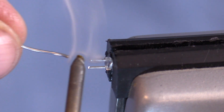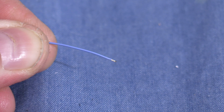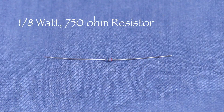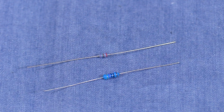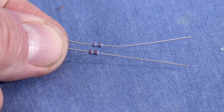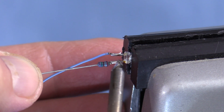Doing this kind of work is easier if you clamp the LED in some kind of holder like a small hobby vise. You can usually strip the insulation of small wire like this using just your fingernails — I like doing this because I know my fingernails won't cut any of the metal strands. Always use rosin core solder for electronics; acid core solder can damage electronic components. A small pencil type soldering iron in the 20–30 watt range is ideal for this kind of work. This is a 1/8 watt 750 ohm resistor — these are what I use for headlights most of the time, though a 1K ohm will also work. 1/4 watt resistors are also okay but take a little more space. I just use these and they work fine in model railroading applications where the maximum DC power to the LED is usually somewhere around 12 volts. If you're preparing LEDs for a different level of power, you might need to adjust your resistor choices. I like to solder my resistors to the negative lead of the LED, though it doesn't really matter — you could put them on the positive side if you wanted to.